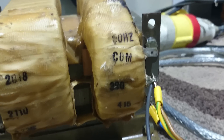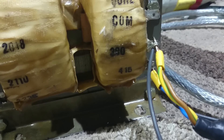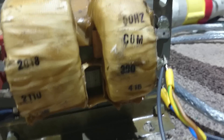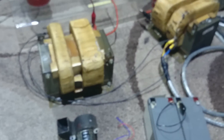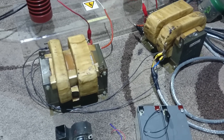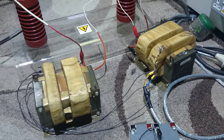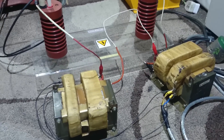I'm not using the common tap — I'm using the other primaries, the 415 and 380. I've wired straight to those on both of them in parallel, so that gives me more output. It does cause the primaries to get a little warm, and of course it's ballasted so it can't pull any more current.